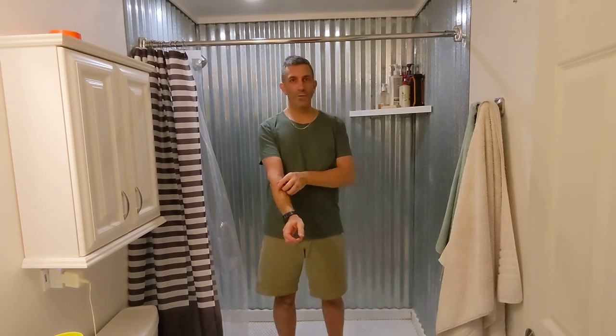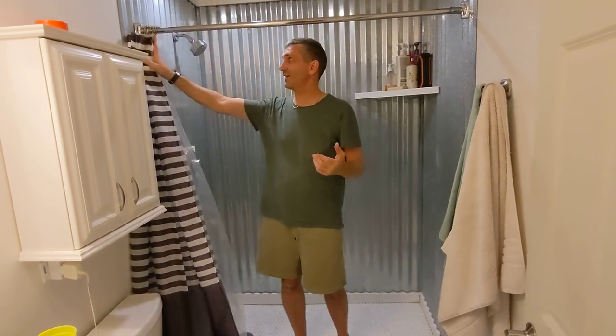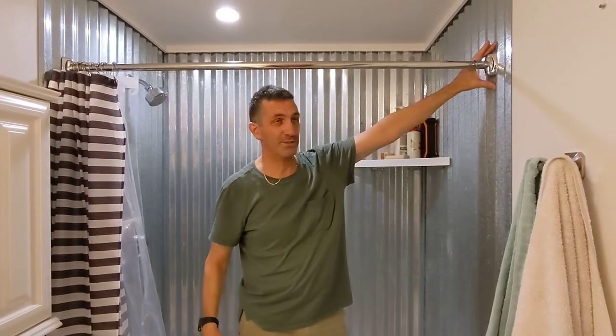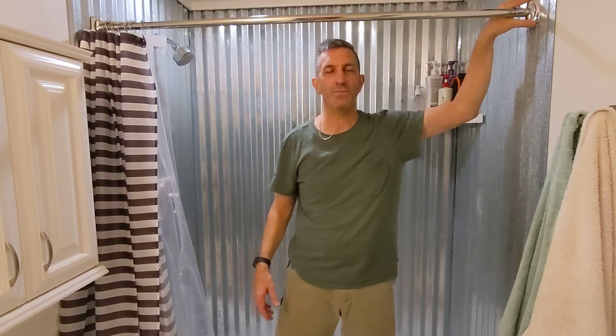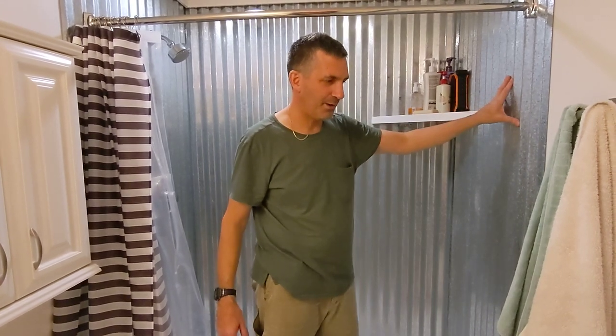Let's do a rough overview of where it is and I'll try to narrate. I've had a lot of questions and comments on this series of videos, so let's go through what we did to put it up. We did this bow-style shower curtain rod. Before I put this corrugated metal up, I made sure to put some 2x4 blocking behind here that I could screw into — basically screwed 2x4s into the studs in the exact place where I knew I would want the shower rod, so I wasn't anchoring into just drywall.